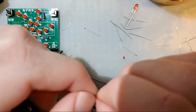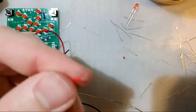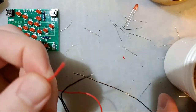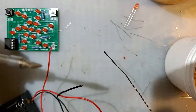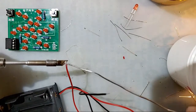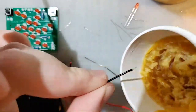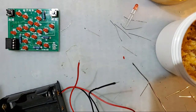You can melt it off with a soldering iron if you have a fume extractor. But here's what Voultar recommends for good reason. Just dip it in the flux there. Get a big gob of flux on there. And then, in most cases, there's enough solder left over on the iron. Or you can heat it up, add solder, that's it. Nice and tinned. Easy peasy. That's all you need to do. Dip that. Boom. Done.